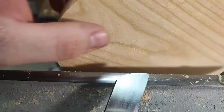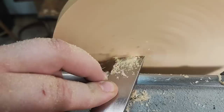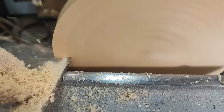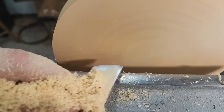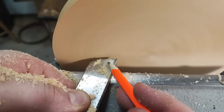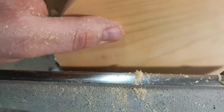We're back at the lathe with the freshly ground burr on top, and now you'll see a complete difference. The way the shavings go over the edge — and the fine powdery dust as well. I'll do a nice clean cut, very lightly. You can see how this powdery stuff is clinging onto my hand and on the edge here — it tells me I'm scraping really lightly, and this surface feels much better now.